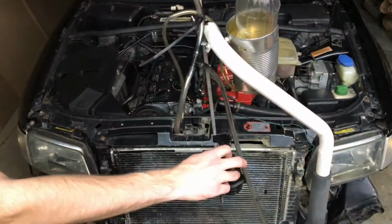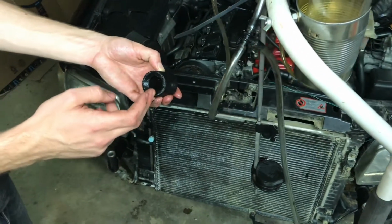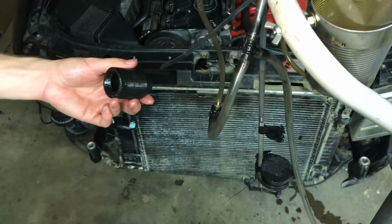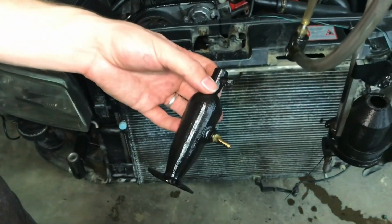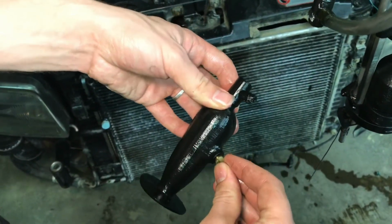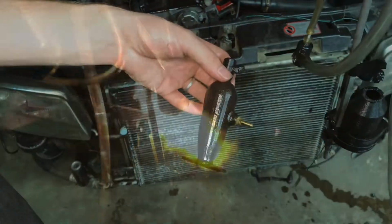So we'll have to do a lot more brainstorming to really figure out what's going on. But right now, we think a smaller nozzle and a longer chamber will be our next step. We might even add a port in the side like this. Here is one that we were playing around with pressure takeoff, so we could hook up a gauge to the side and just see what our chamber pressure is.